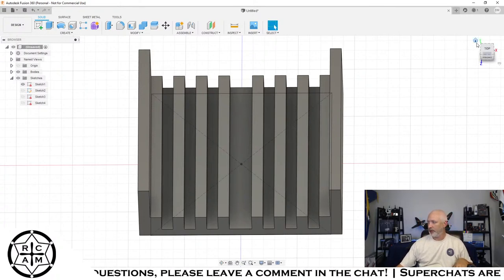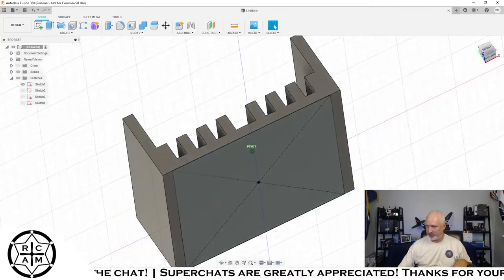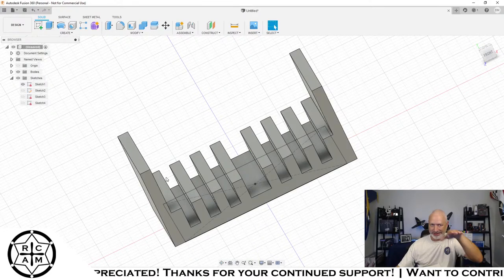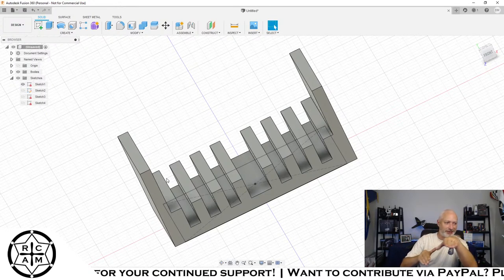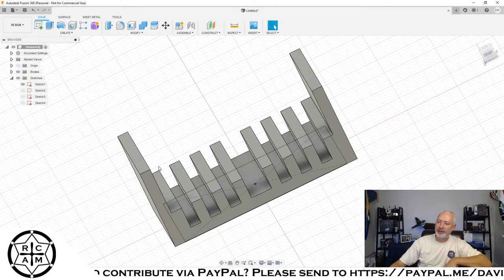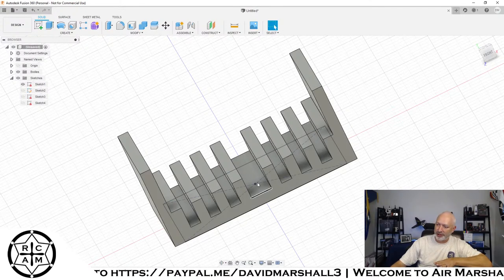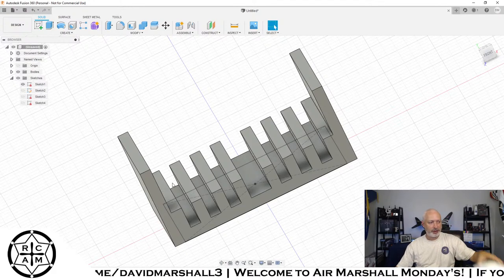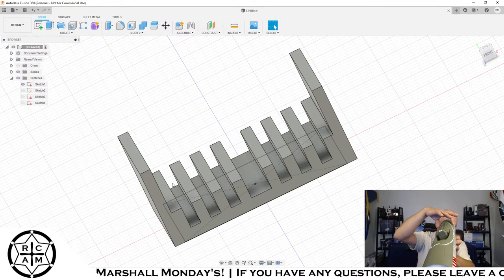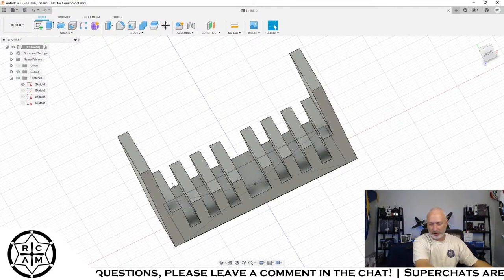All right. So what we have here now is a piece that the VTX is going to sit inside of. It will be prevented from moving side to side by these walls here, which are 4.5 millimeters tall. The heat spreader will sit on top of these little grooves, which have some air channels. There's going to be an opening in the canopy that's going to allow air to go through there, which will flow right through those holes and provide plenty of cooling air for that VTX.